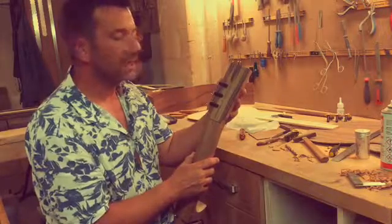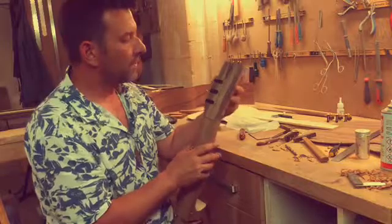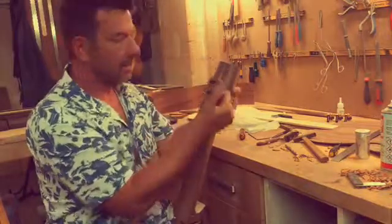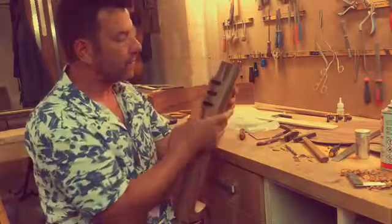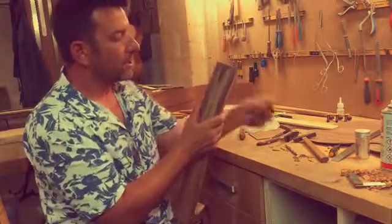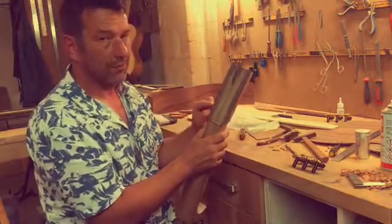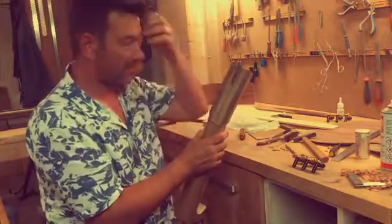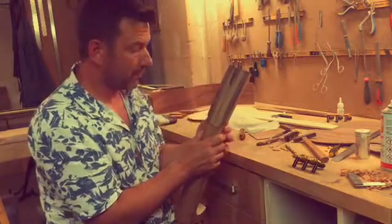Indeed, the measurements that we take for various stages along the way here will be taken from either face, calling that the flat surface from the point of view of squaring lines. The other thing is to ensure that we drill the holes before we cut the slots out of the front. This is something I found out to my peril.